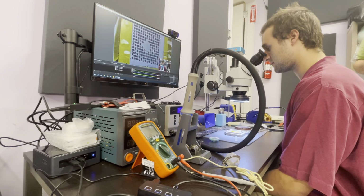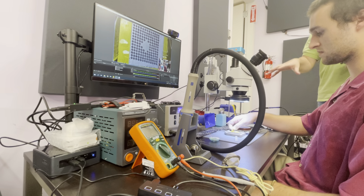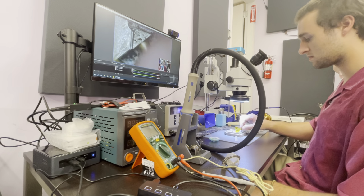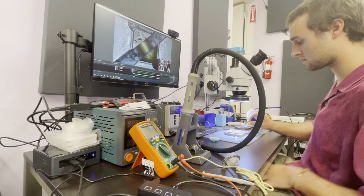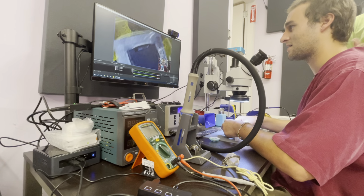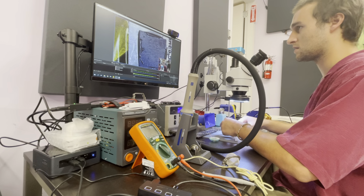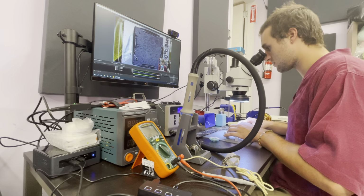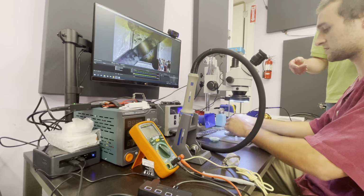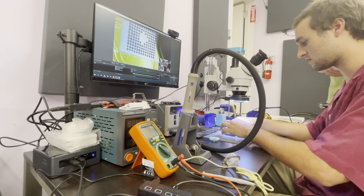Should I take the stencil off now? Yeah, sure. It might not come off. You might have to heat it again. People think that they need to melt the solder again to get a stencil off. You don't need to do that. It is really adhered on by the stickiness of flux. That stencil is flat up against that chip now with a bunch of flux in between it. So all you have to do is heat it up enough to get the flux to turn to liquid, and it'll pop right off. I want to do that tomorrow. I don't want to try it now. No, keep it right side up. You want to heat the balls, not the chip itself. Okay. Yeah, so put it back in there, tighten it back up.